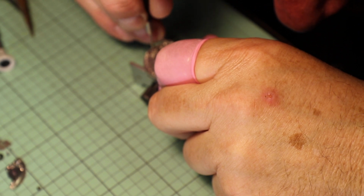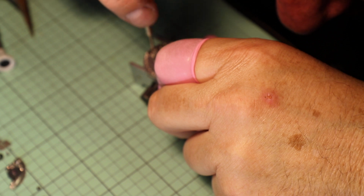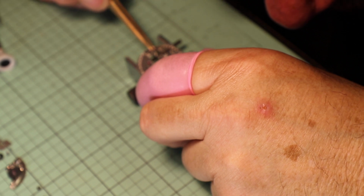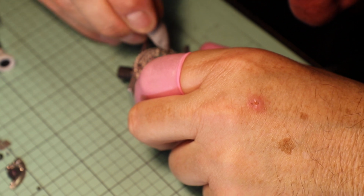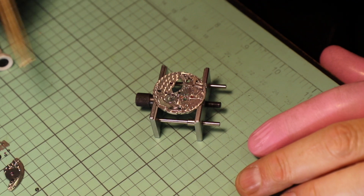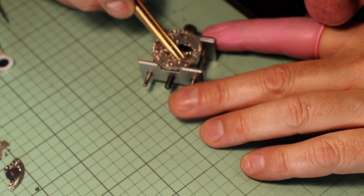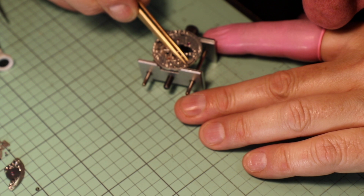Okay. This is a retaining spring that holds down your set lever. I believe on this watch the screw is the same as the others, but on a 3035 it's longer, so keep that in mind. 3035. Is that the movement before that? The movement before. It would have been in a transitional or a vintage Submariner. And this 3135, this is the current movement they have in the Submariners, isn't it? No, now they have the new movement with the Parachrome. Gotcha. And the only thing they've changed in the last couple of years is made it 1mm bigger, haven't they?